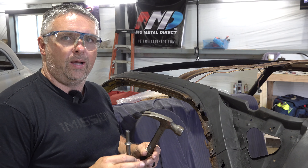So that's what I'm going to do over on the driver's side — we'll kind of just speed through that quickly so you can get an idea of what I'm doing. And then we'll try and at least get the passenger side tacked on, bring over the roof and set it on here. Once I get the driver's side cleaned up with that bad metal, I'm going for a baseline here — so let's just go ahead and get the other rail off and tack this new one in place.